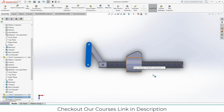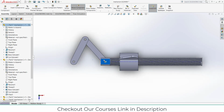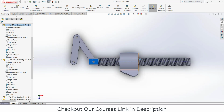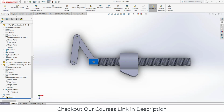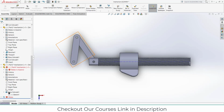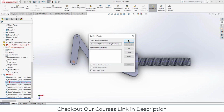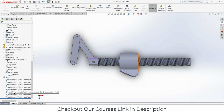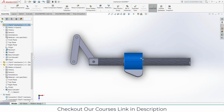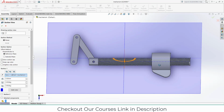and select this face, press Ctrl plus 8. So as you can see, it is going quite inside, so it is not correct. So what we can do is, for a second, first delete the sketch, delete that, and right click on it, click on suppress for a moment, and we will move this forward up to this point. And first check the threading,